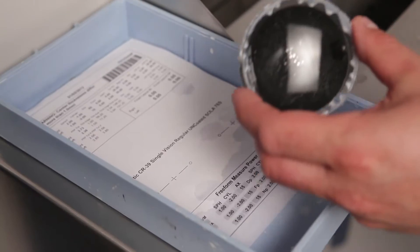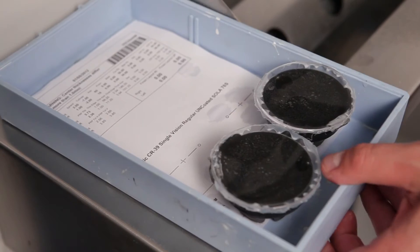The Cobalt polishing system's tool set — the tools used to polish the lenses — 80 to 85% of the work done in the lab will be done on a single tool. There's a total of three tools for larger or smaller diameter lenses, but the bulk of the work, about 80%, will be done with a single tool.